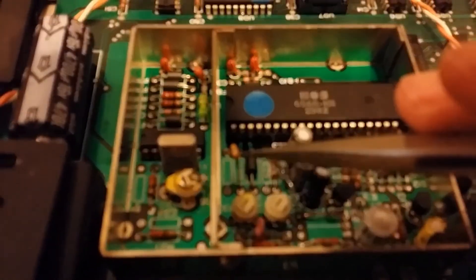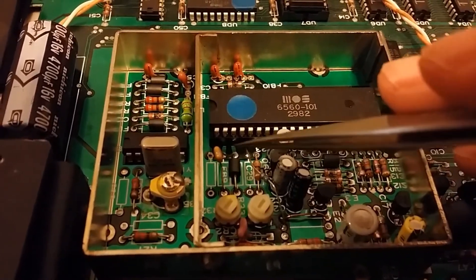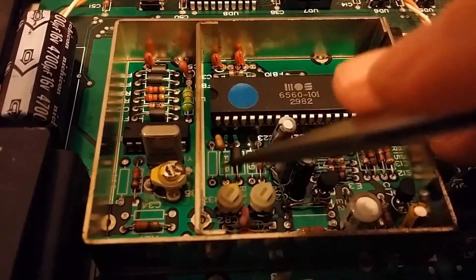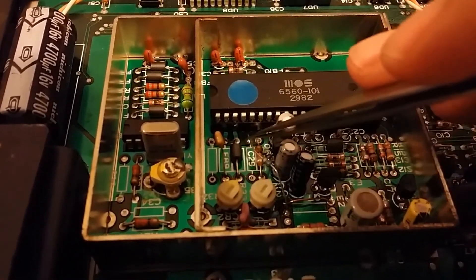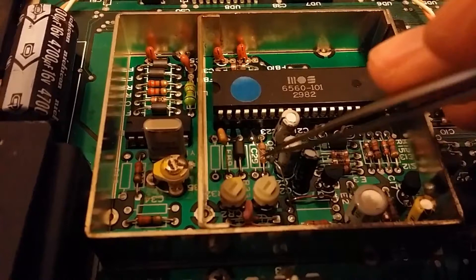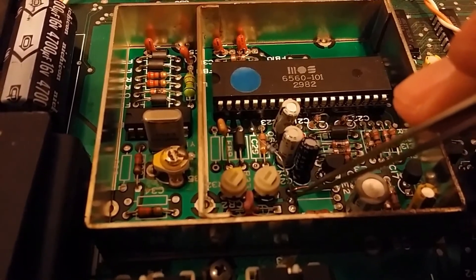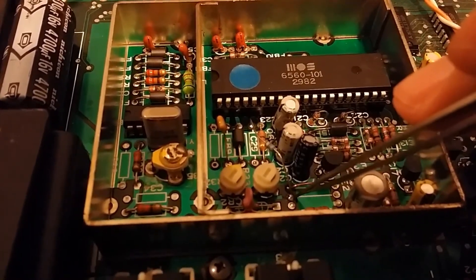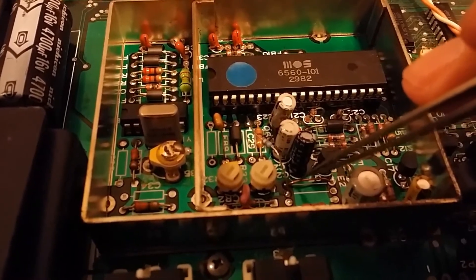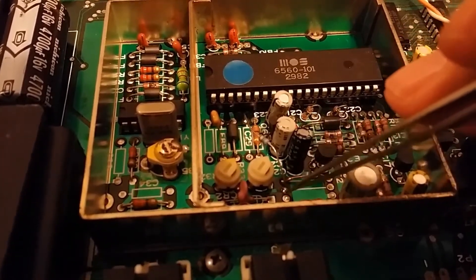What I have done is put in a small 0.1 microfarad capacitor right here. And I put in the 75 ohm resistor right here, because this connects - it jumps over to here. But the resistor, instead of plugging it in here, I have it spread out all the way to where I pulled out the small inductor. This goes directly to pin 5 of the AV pinout. This jumper here supplies pin 4 of the AV pinout. And this is basically our luma signal, and this is our chroma signal.